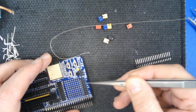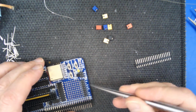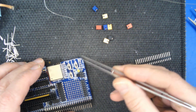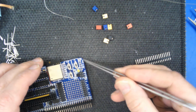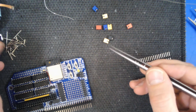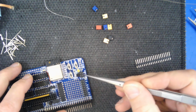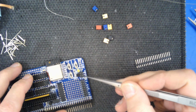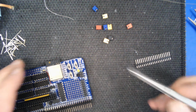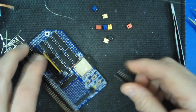So we'll be connecting jumpers across those, and then it's also optional how you connect this serial connection, which goes off to a PC or Mac or whatever. So this is a point for a cable that converts from USB to serial protocol, and then these points here are, as I said before, for the Z80, choosing which channel of the Z80 serial you want to use if you're using serial on your Z80. But the only one that's critical is really the Pi ESP connection, depending on your application.